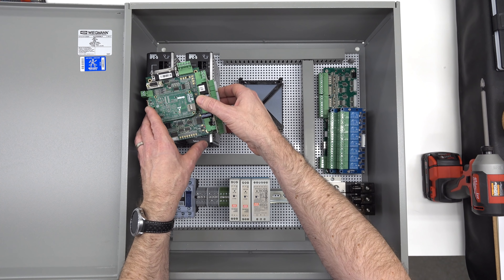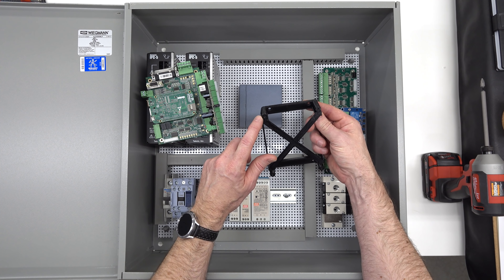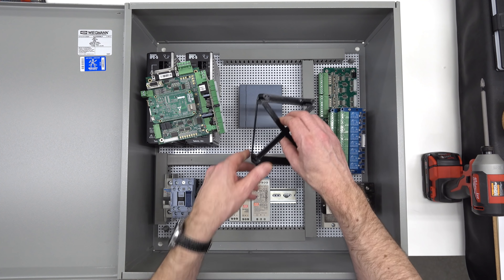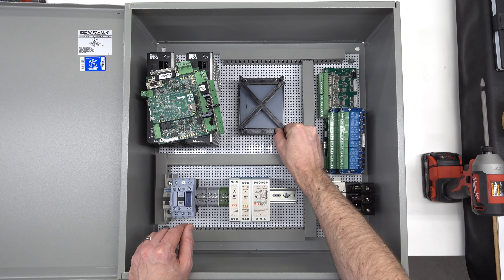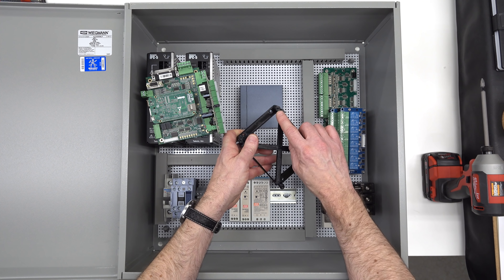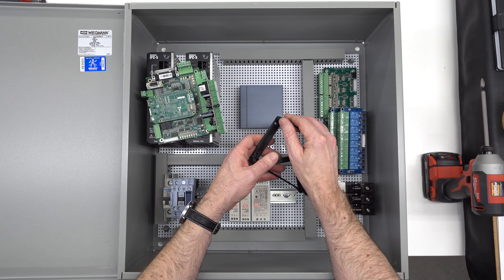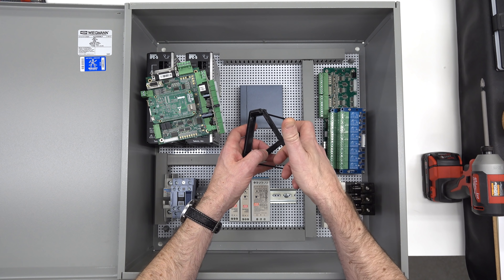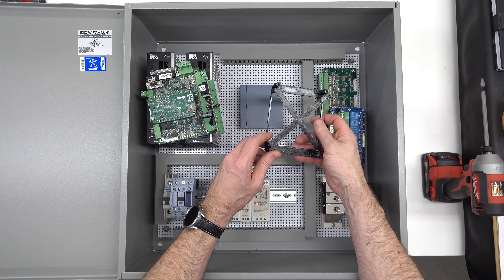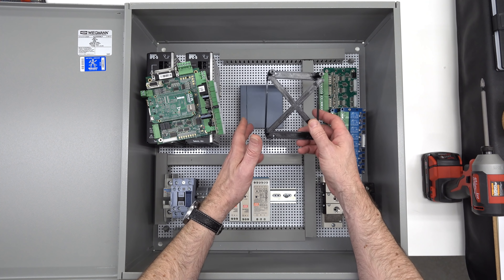When I made these parts initially, I just left holes in the corners and then drilled them out to make sure they were the right size and threaded them, just tapped them with a high-speed steel tap. And that works, but as I've put this together and taken it apart a few times, these holes are already starting to strip out. When you tap a hole in plastic, the plastic kind of stretches during the tapping operation and then squeezes back down, so it kind of grips the screw and you can't spin a screw in with a screwdriver — you have to crank it in all the way down. This is what I'm hoping will be a lot better with the brass threaded inserts, and from my experiment so far, it is just night and day. It's a 'where have you been all my life' experience.